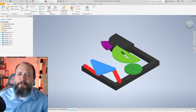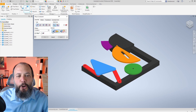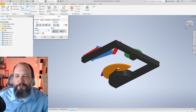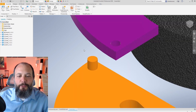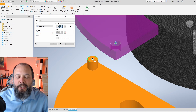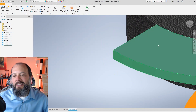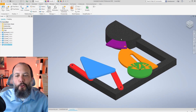The hole in the purple block is intended to fit the pin on the orange semi-circle, so I'll do a rotational joint for that. First I apply a constraint in the opposing direction so the top surface of the orange piece lines up underneath the bottom surface of the purple, then Apply and Cancel. I drag the pieces closer together, open the Joint dialog, select Rotational, left-click the hole, then left-click the pin. It looks like the slider joint breaks, but as soon as I hit Apply and Cancel, the slider joint snaps back into place and the orange piece moves along with the slider.